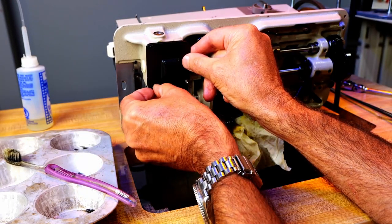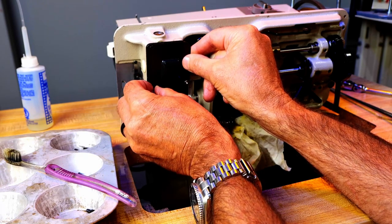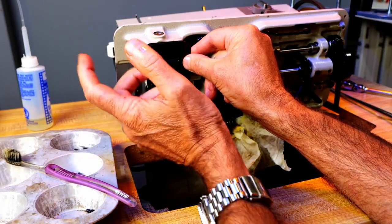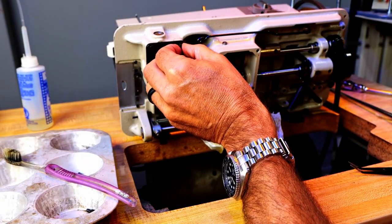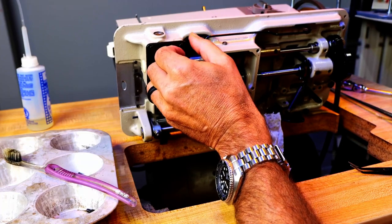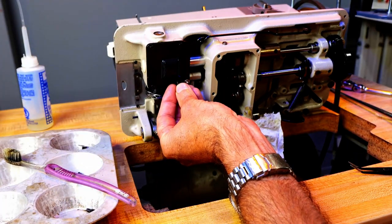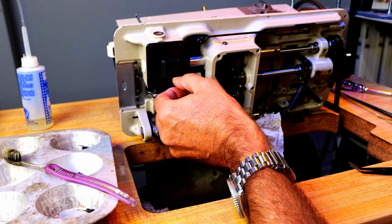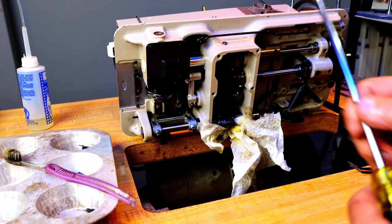When you're starting these little screws, make sure that they get started by hand. You can turn it 1, 2, 3, 4, a few times by hand, and you'll never cross thread your screws if you make sure you get them good and started by hand. So I can turn this in, so I know that I can tighten that up with a screwdriver now. But they're kind of tough in the beginning, or at least the first three were. This one started a little easier. But once you turn it in 2 or 3 screw threads, you know you're good.